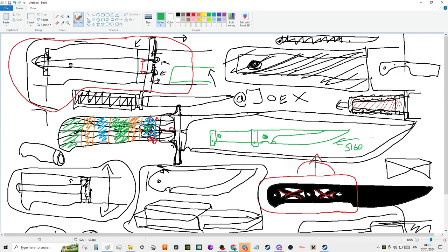And the cold forging happens when you anneal. You forge the blade, you anneal the blade, and then you cold forge it when it's cold, after annealing. This prepares the surface, makes the surface very nice and smooth, but it also makes the steel much, much tougher, at least less prone to fracturing. And so those things combined, even through the abuse tests, a hole here hasn't been an issue.